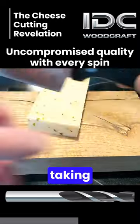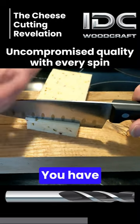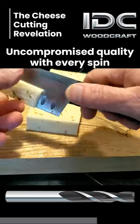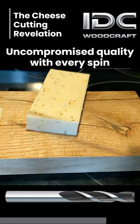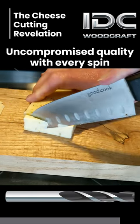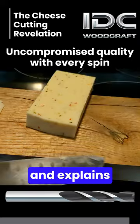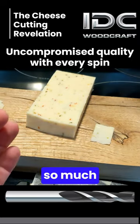It's kind of like taking a knife and slicing your cheese like that. You have to use extra force with both hands to make that cut. However, when you're using a spiral bit it's basically shaving like that, which is much easier to do and explains why the spiral works so much better.